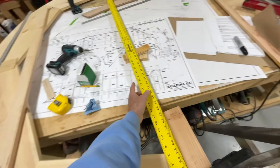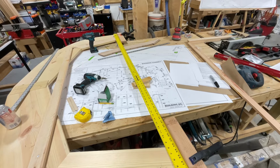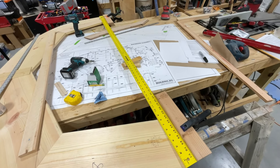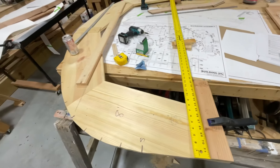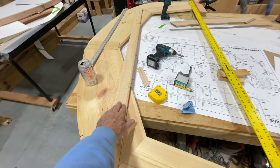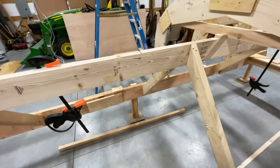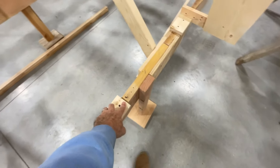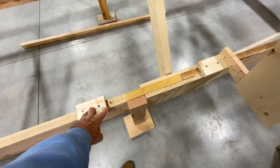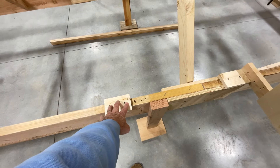One of the things I'm doing is I'm taking this big long ruler and running it along there and making sure that that's straight - both of them in relation to each other. The other thing is we've got to put this piece in and this is what helps it be secured to this center beam up here. Here's the mark where this next frame is going to go and I've got it marked off down here as well, and I even have a block in here that it should butt up against, but I'm not sure that's exactly in the right place. Obviously we can change or adjust it.